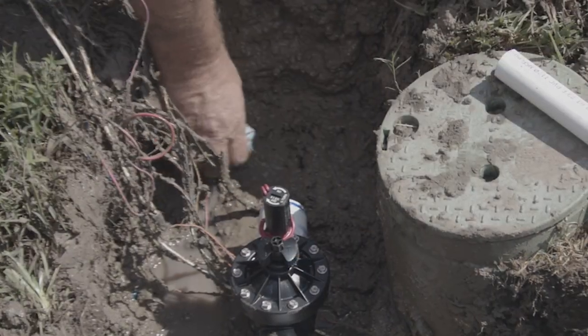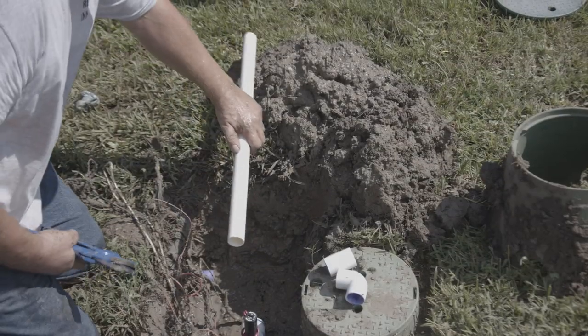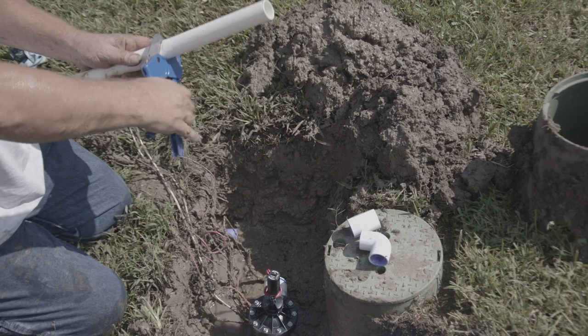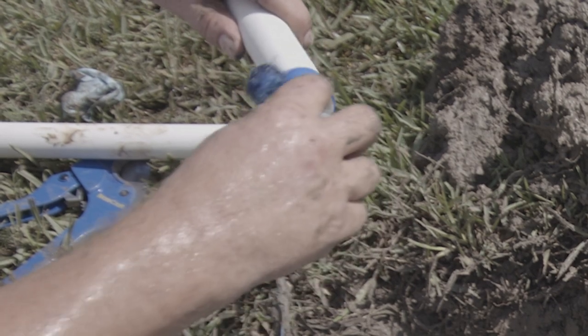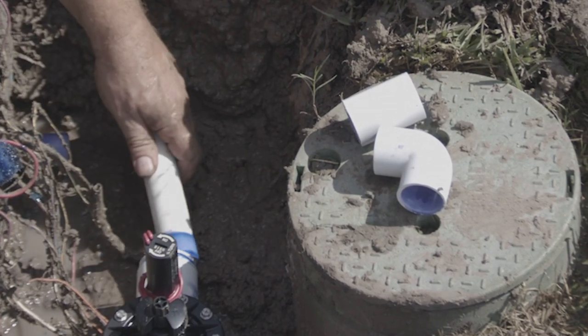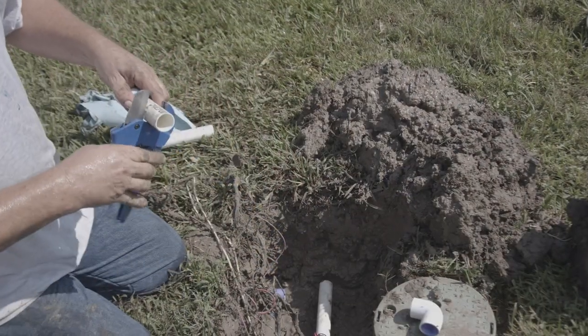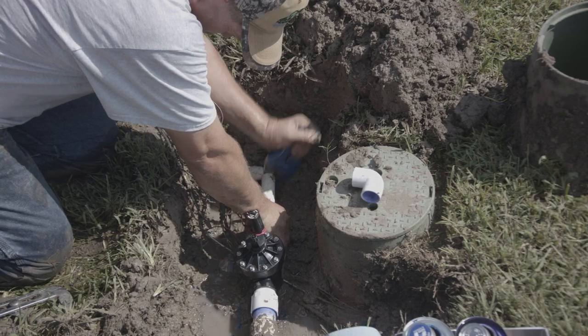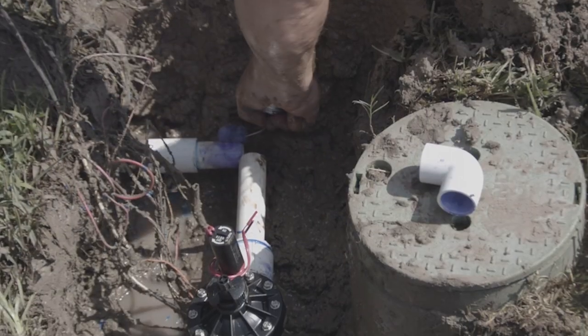The pipe he's cleaning now heads off to the sprinklers. This section of pipe being installed — the section between the valve and the elbow — he's cutting a little longer. What he's doing is overlapping the pipe so he can cut off the excess and get a very accurate fit. Now if he had tried to measure the distance and came up a little short, he'd have to redo the whole pipe coming out of the valve. Cutting off that excess — notice the corners of the two pipes are touching, which is going to ensure a good fit for that elbow.